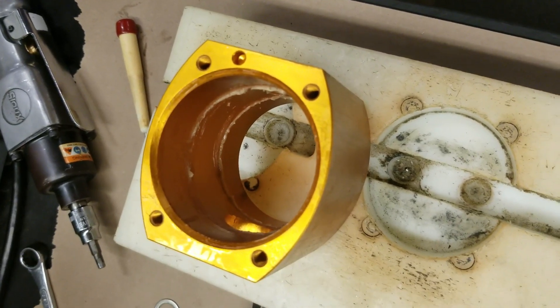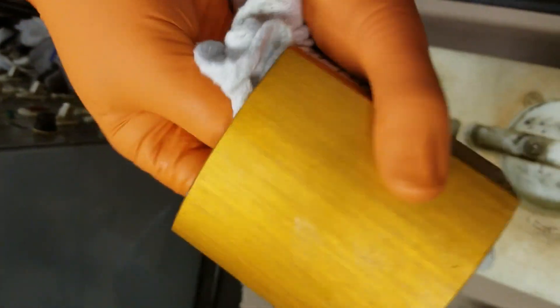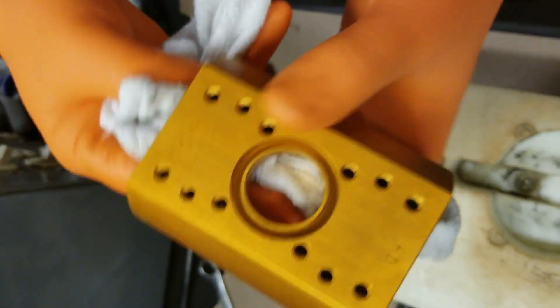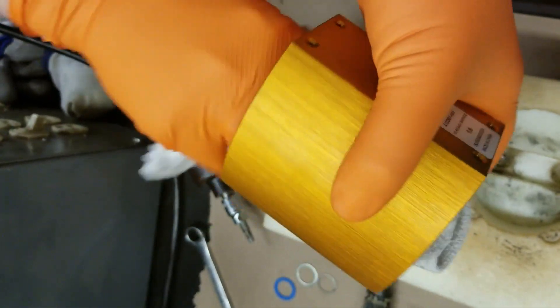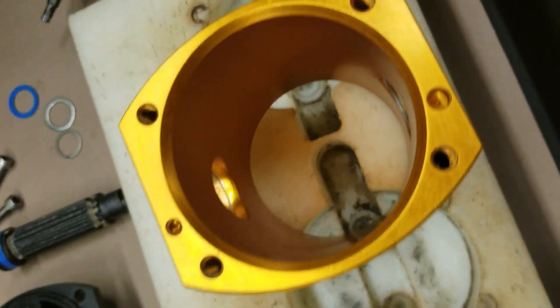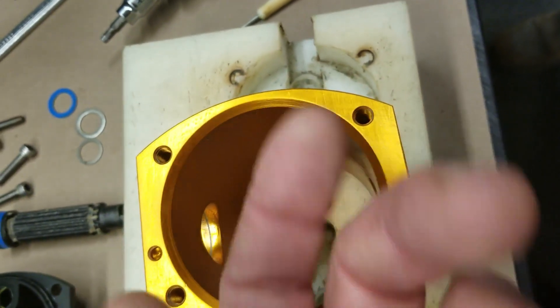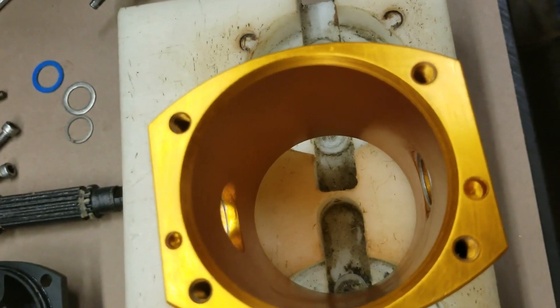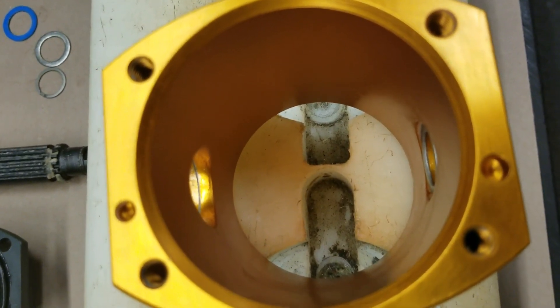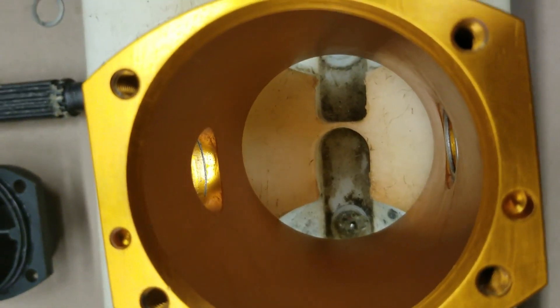After disassembly, we want to start cleaning the actuator body and getting it ready for reassembly. Take a rag and remove all the old grease out of the actuator. This may take some cleaning fluids — possibly alcohol or something like that if there's water contamination inside. You want to clean your actuator housing out real good. Make sure there are no scuffs or gouges in the body where the seals ride, as these will cause O-rings to fail more quickly. Make sure the bore of the body is in good condition.